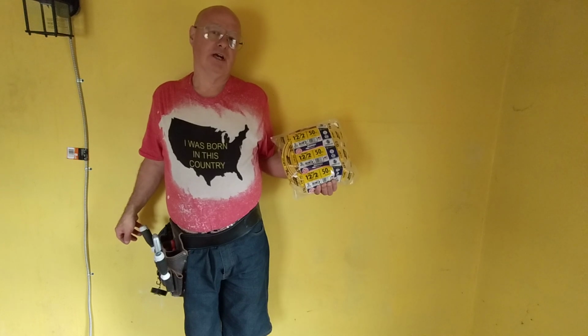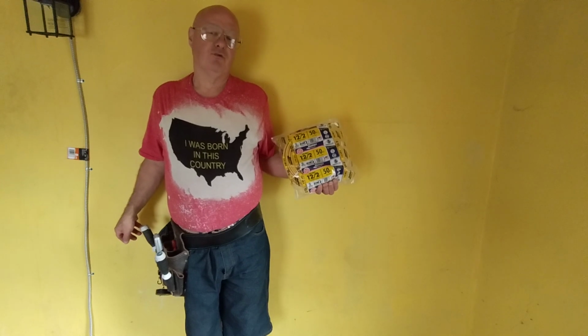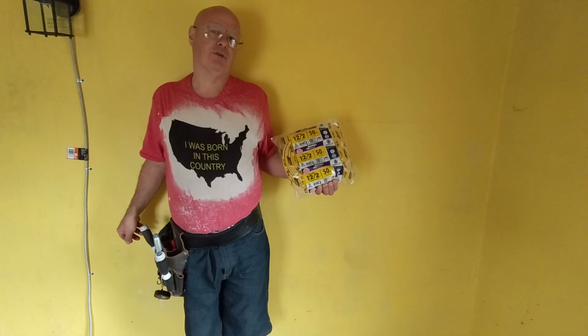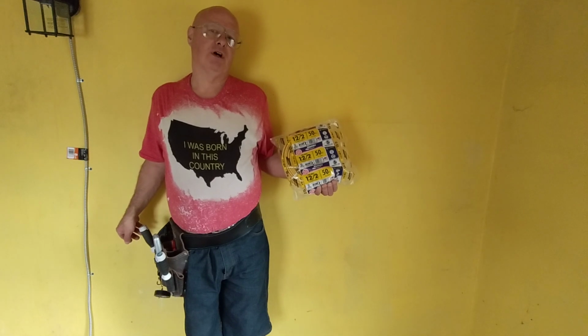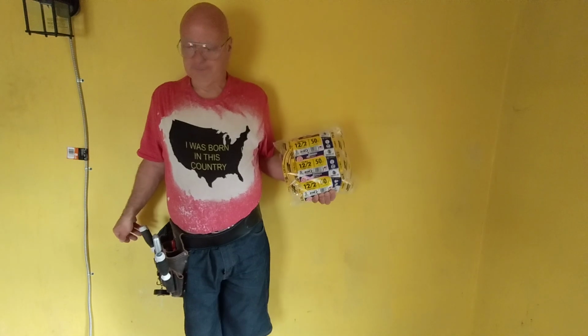Red and blue are also live colors, but you may find white live in a switch loop and also on a 220, 240 volt circuit that requires a neutral. So I'll show you how to use an old workbox and put a new outlet into a kitchen from the breaker box according to the NEC, the National Electrical Code.